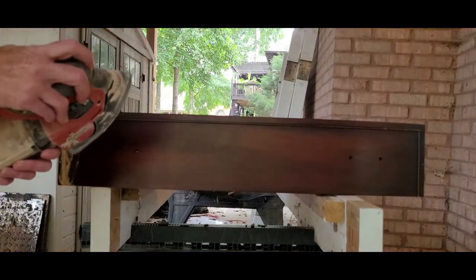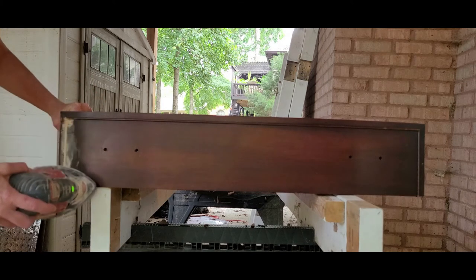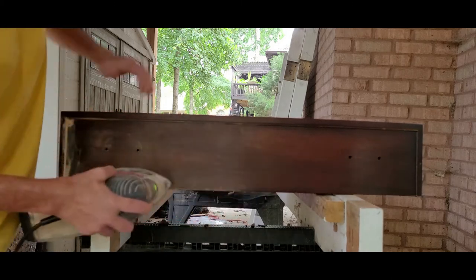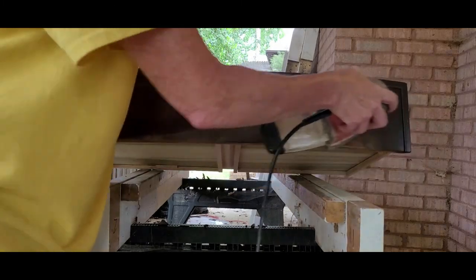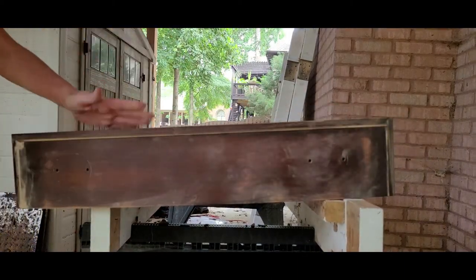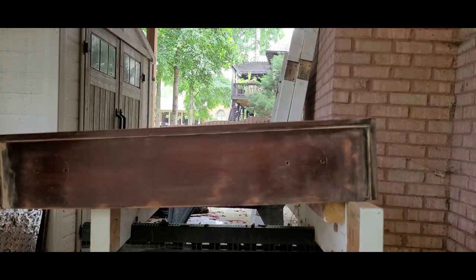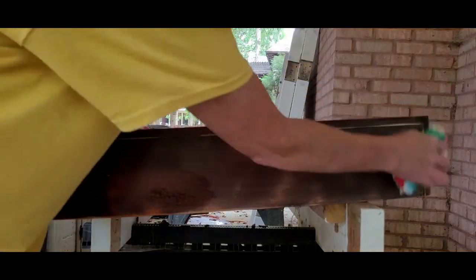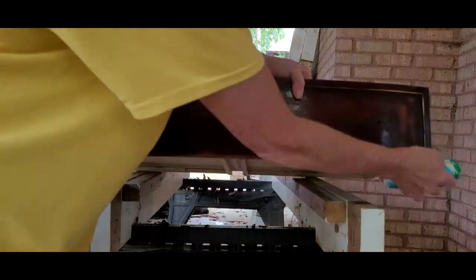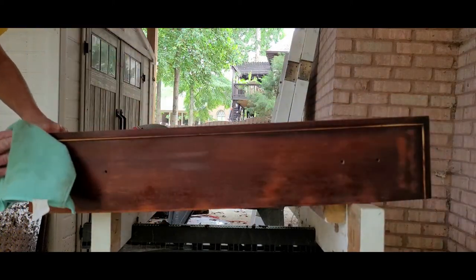Here's our first step. Now that it's dry, I'm going to sand it — you can see me sanding this first drawer. I'm going to get everything level before I put the new piece of trim on, and then I'm just scuff sanding the rest of it. Once you finish your scuff sand, you want to make sure that you get all of that dust off. I like to use my microfiber sponge with some water to get all the dust off, and then I take my microfiber cloth and dry it.